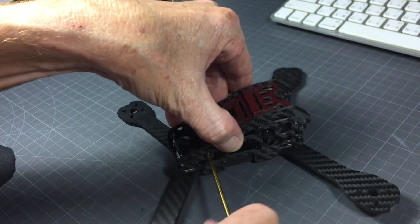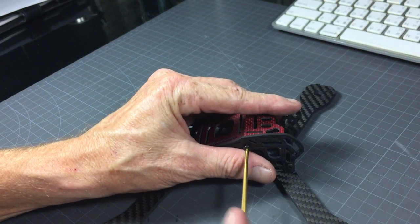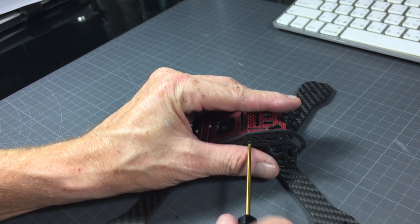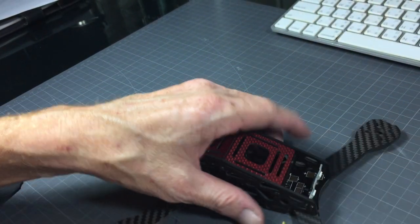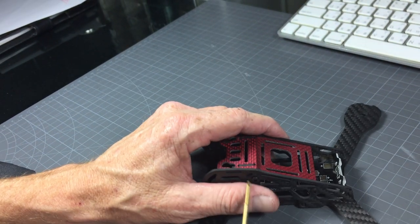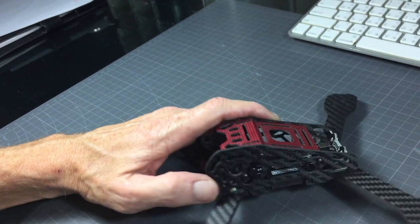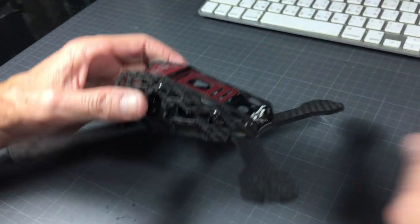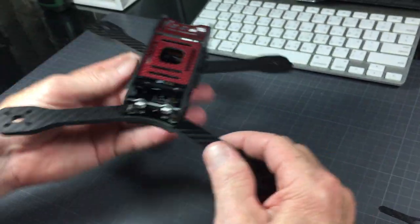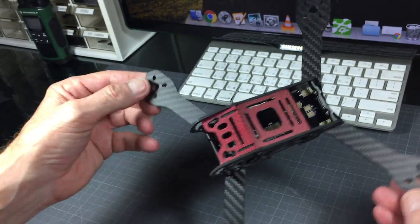I'll select the angled option. As you can see it's angled this way, but when the quad is pitched down it's actually 90 degrees — easier to see for the pilot behind you. Now I can go ahead and secure the bolts on this side nice and tight, and give the other side a quick tug as well to keep them nice and tight. The frame is now fully assembled.